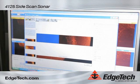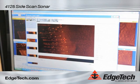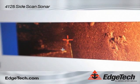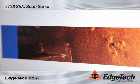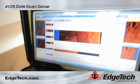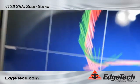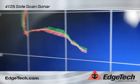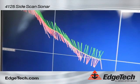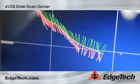With the target logger, a simple right-click of the cursor brings up the target logger screen. We can zoom in on these targets, save them, or measure them. You can also take measurements on the pilings simply by clicking and dragging the cursor — we can get length, width, and shadow height, which tells us how high the target is off the bottom. Once we have done all that we can save these targets and review them later. The targets are also saved in the coverage mapper screen, where the X indicates the target we just saved. If we want to go back and re-scan that target, we can simply look at the coverage screen, bring the boat back around, and go over that X marks the spot again.